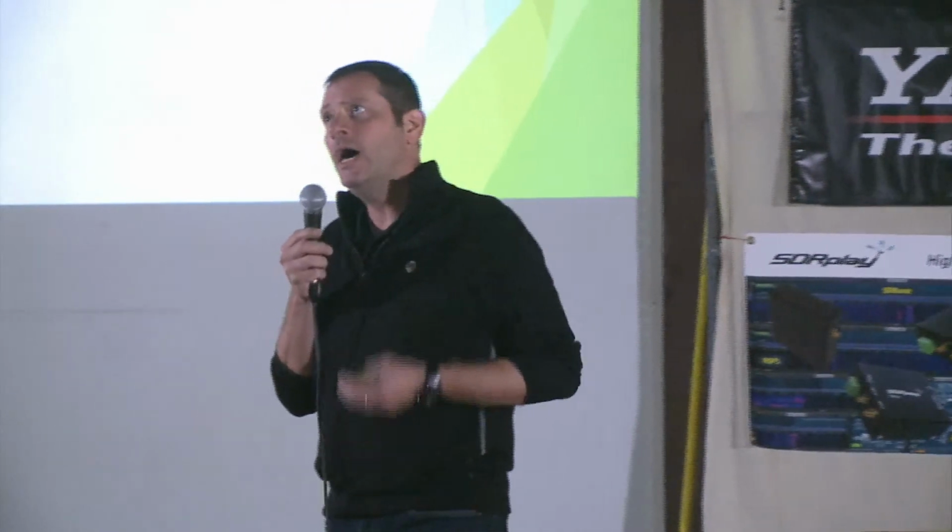And that is another thing with braid coverage. You talk about braid. There's a lot of stuff that you get when you don't have control over the process and it's built at a subpar level, the braid can fray. So if you're ever trying to connectorize and you're stripping something, the braid can fray because it's not made of copper or tinned copper. It is a variation of that, and it will fall apart. And when you have that, you do get a lot of interference.